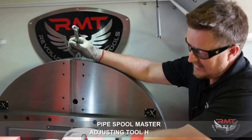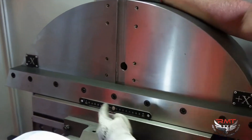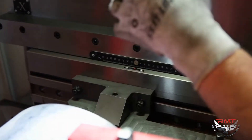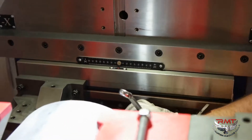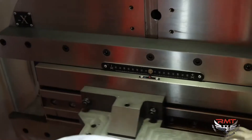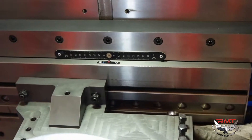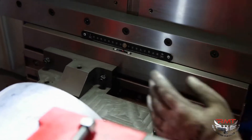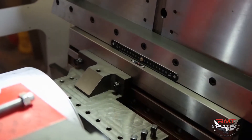I've loaded up a different size of pipe than I had before. Now I've got a lot of range on my x-axis, but if I put a different size of pipe than I had, that requires a change — I need to slide my tool. You can see I've got a lot of range here. Pipe Master has a really wide range in one machine. So I just loosen my four bolts and center my tool on the pipe.